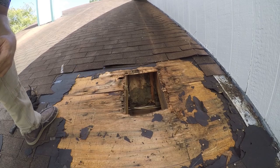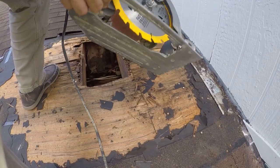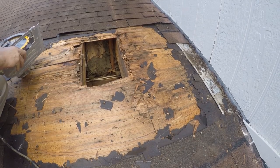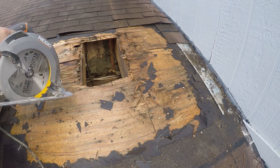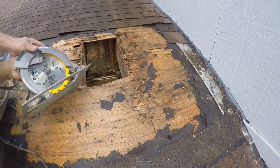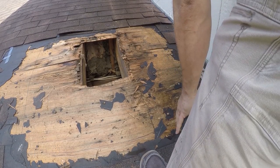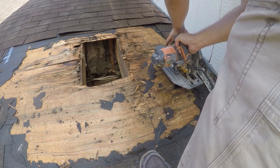I've outlined where I'm going to cut out, and I'm going to go get my saw and get busy on that. First things first, you want to set your depth of cut to be about what your board is — I've set it at about half an inch. What you want to do is cut up the middle of the stud. Don't use a blade you like, because this is rough on blades.